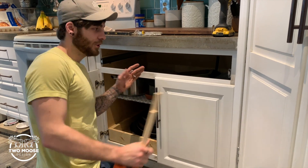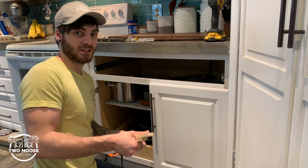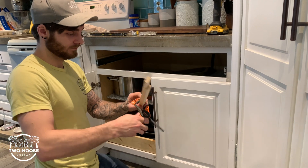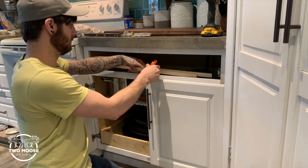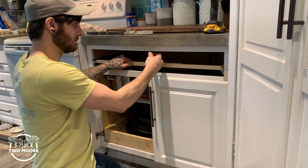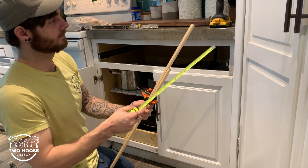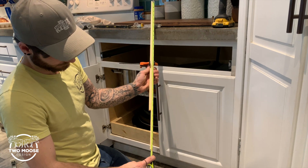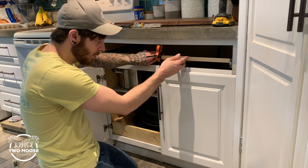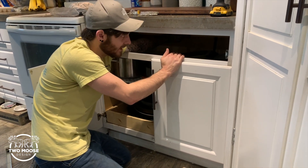For this application your drawer should be the same exact size, but because I put different slides in I'm going to check it just in case. I like this simple method: two pieces of scrap and a baby clamp. Spread it out until it's snug on both sides — this gives you your total measurement. It also helps you know if your slides aren't even because the back should be equally as snug as the front. And it is: 31 and 7 eighths.